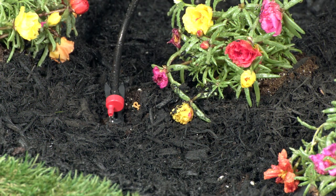Goes without saying, if we're going to install a drip system, we've got to somehow get water into the drip system. If this were a standard sprinkler system, you wouldn't want to supply water from plumbing that's been installed in a building or house. However, when using a drip system, the water volume and water pressure is lower. So if you're installing something that uses say 220 gallons per hour or less, you shouldn't have a problem.